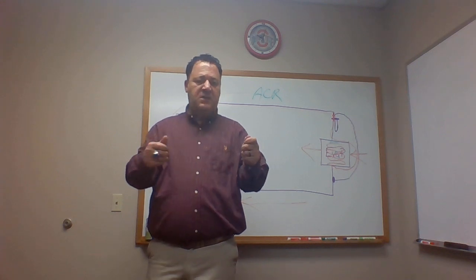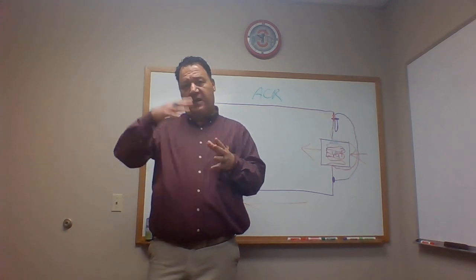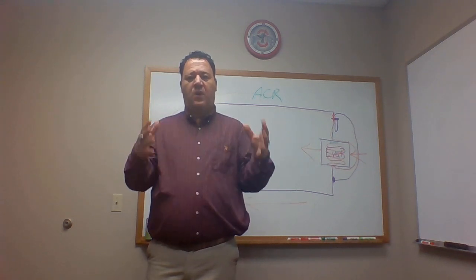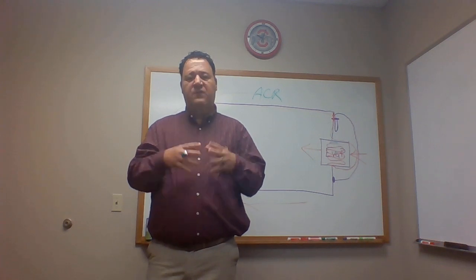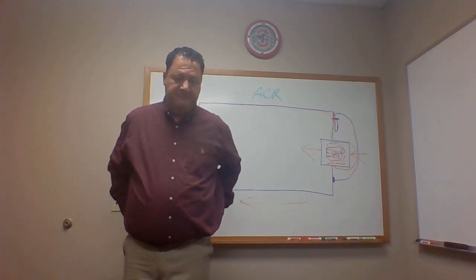So if you ever look at a manual and it says, well, if we're running 50 foot, they want us to use a 3/8 and 3/4 inch line set. If we're running 100 foot, they want us to use a 7/8 and a 3/8 line set. And you wonder, why is that? Well, it matters, okay? Over time, it matters, all right? So the longevity of the compressor will depend on how you do that, all right?